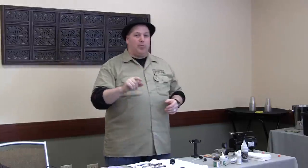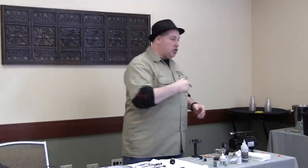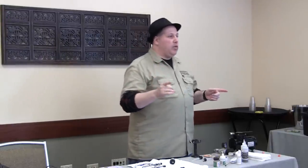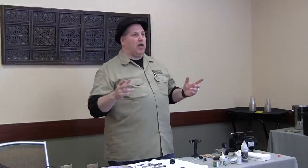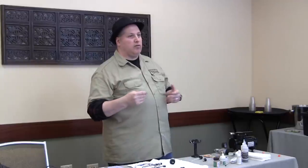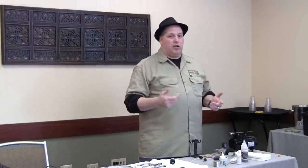And thank you for bringing that up, because one of the things I was just about to forget to mention was, if you're someone who has a tank compressor, which serves as an additional moisture trap for you, always remember to drain the tank. Because if you don't, in a matter of 6 to 8 months, you end up with a rusted out tank. That's a very costly thing to replace. You're almost in the position where you have to buy a new compressor if and when it happens.